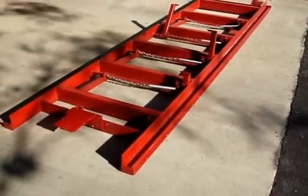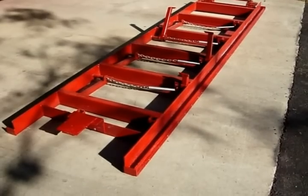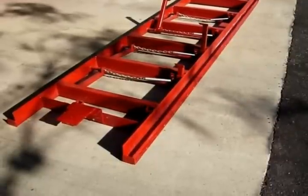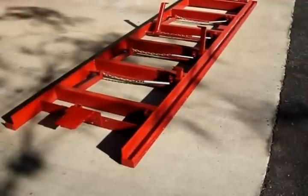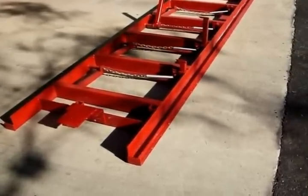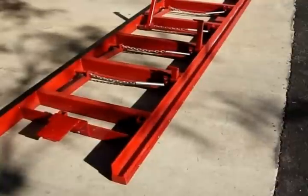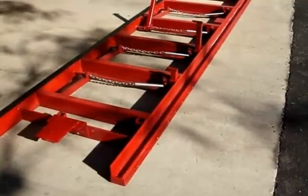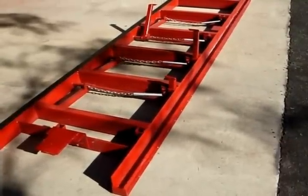This is my track for my sawmill - very simple and super strong. I use angles for holding it together; they're 5 inch by 3 and a half, quarter wall. For the tracks it's a 1 inch angle, quarter wall, and the wheels roll on them. To make it steady I bridge it with 2 by 5 inch rectangle tubing, 3/16ths wall. All coupled together, it is exceedingly strong.